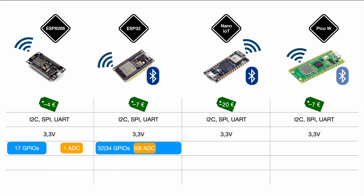There's more: the ESP32 comes with a second ADC on board providing another 10 channels for analog-to-digital conversion. However, those 10 channels normally don't appear in the pinout because as soon as you turn on Wi-Fi, you can no longer use this second ADC. Since this comparison is all about Wi-Fi, we will ignore those 10 additional ADC channels. I'll put a link in the video description where the pinout details are explained in a nice blog post.